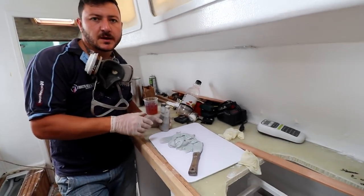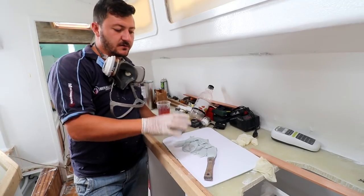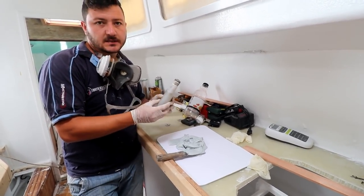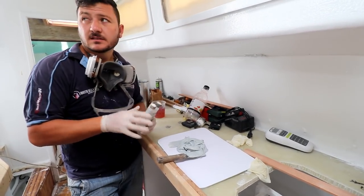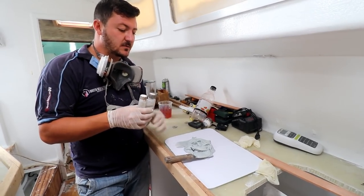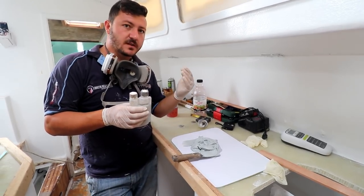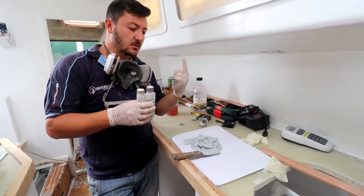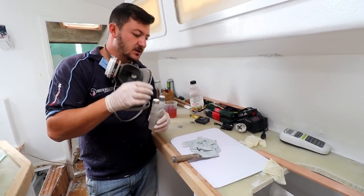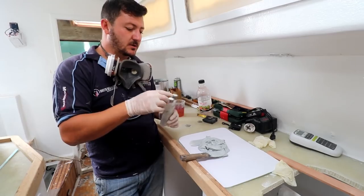This is some bonding paste. If you guys don't know what it is, it's basically a structural polyester mix — it's got fillers, resin, everything in one, with a good consistency to it. This is a catalyst that makes it react. We go to 3% catalyst by volume. A little chilly today but it's going to warm up nicely throughout the day. We'll use this to secure our core in and then glass over it directly while it's still wet, so it's a chemical bond as opposed to a mechanical bond where you'd need to roughen it up afterwards.